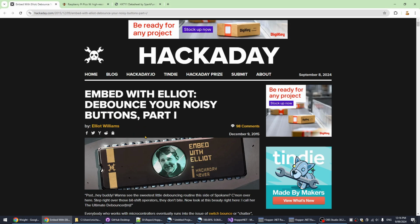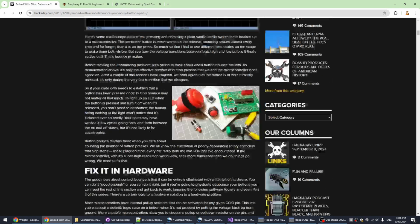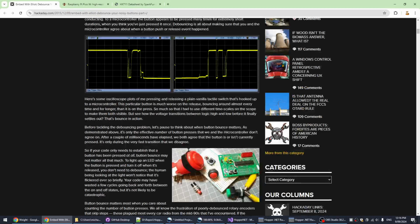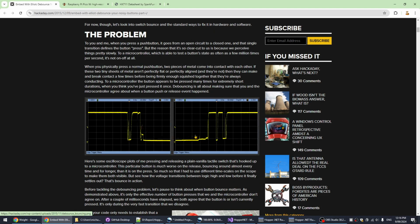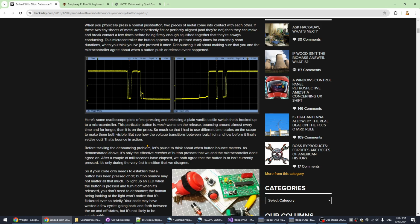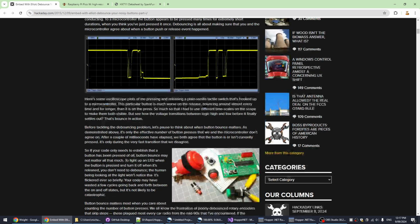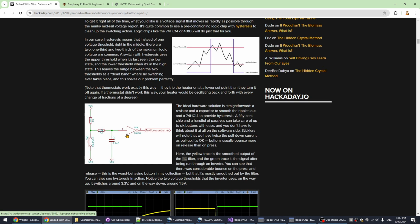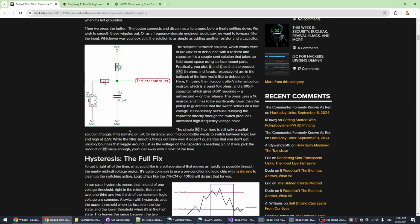So Elliot has this really good article on debouncing buttons and why you need to do it. So basically, if you have an electrical button and you press it, there's like sparking that happens inside the button, and you get multiple clicks for every click. And I'll put a link to this in the description as to why you need to debounce a button. So you want to debounce a button so you get only one event that gets fired. Otherwise, we'd get multiple events fired for every button press we hit. And he's got sort of two levels of debouncing, and the one involves using an IC as well. But I find that his first circuit is perfectly adequate.